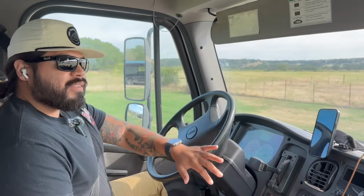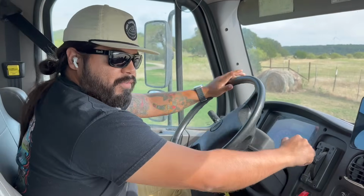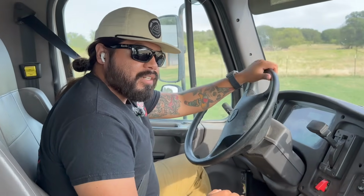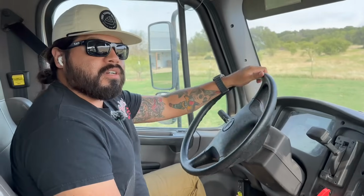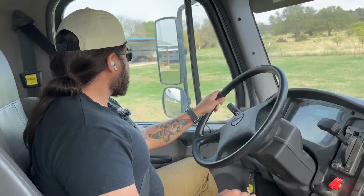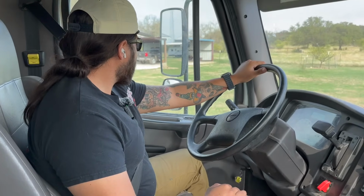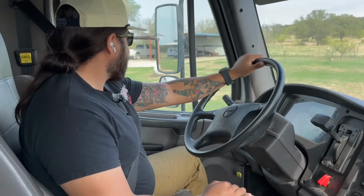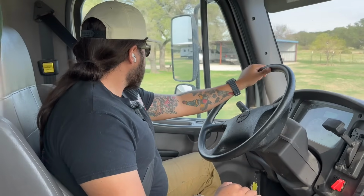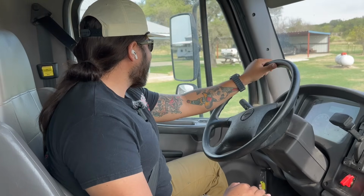2016, that's about 7 years since installation. So we generally recommend pumping it out every 3 to 5. And we're about to get a good look and see what it's gonna look like after 7 years without having it pumped out. Looks like a conventional 1,000-gallon tank with two compartments. And this customer is awesome. He's waving me back in right now.